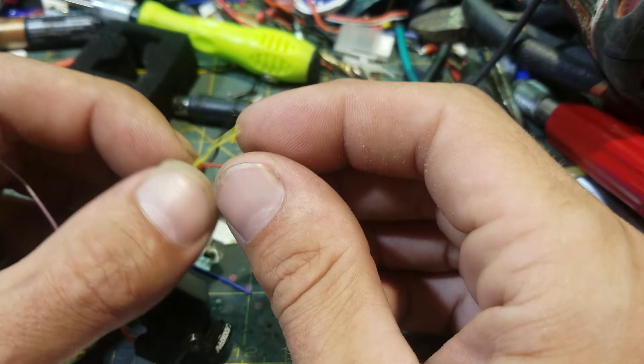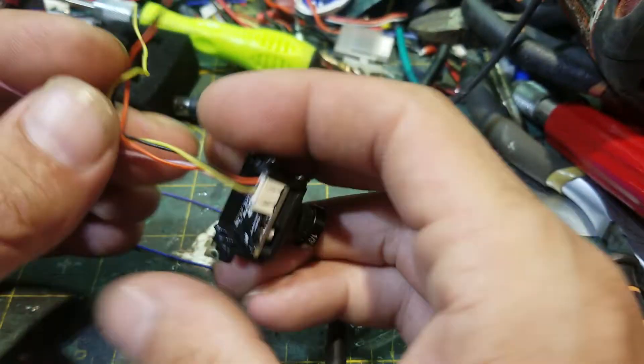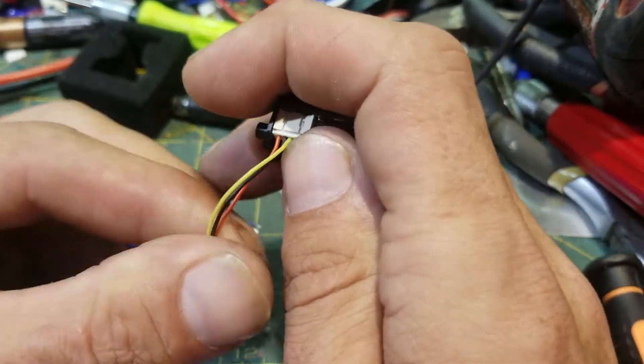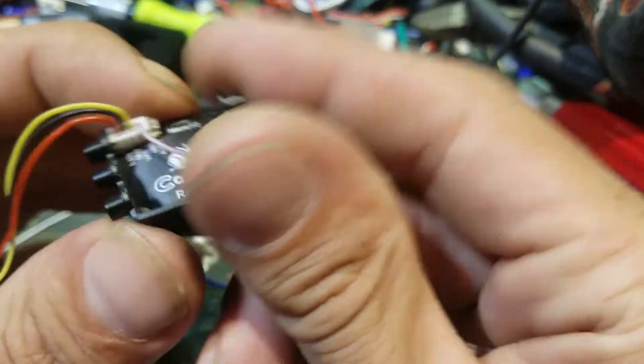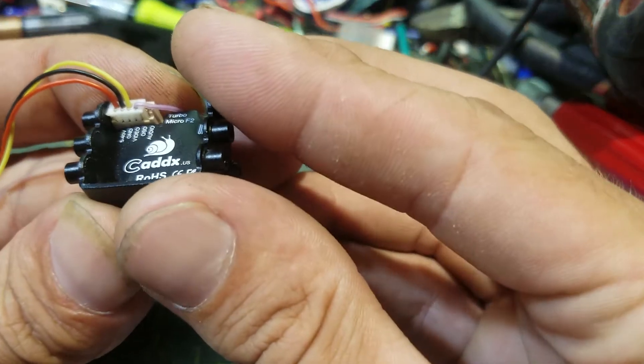A way that I always do it: usually they have three pins coming out — red, black, yellow. This one has a purple one too, don't just ignore the purple one. You want to double-check that that's the right pinout coming out if you're using another connector, because not all connectors are created equal.